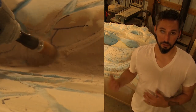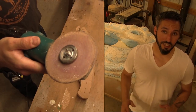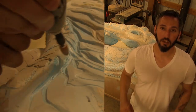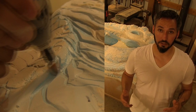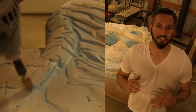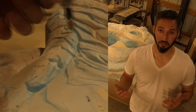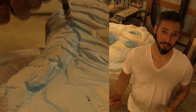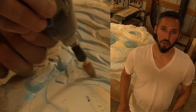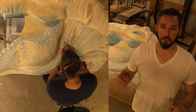Another useful tool is a four-inch angle grinder. What you didn't see is that during the process of laminating the foam pieces together, those were basically roughed out with a four-inch angle grinder with a 50 grit flap disc. The flap disc can actually make the foam heat up fast, so wearing eye protection is essential, and a respirator too, because it likes to throw hot pieces of foam. It does make quick work of it though — eases through it like cotton candy.